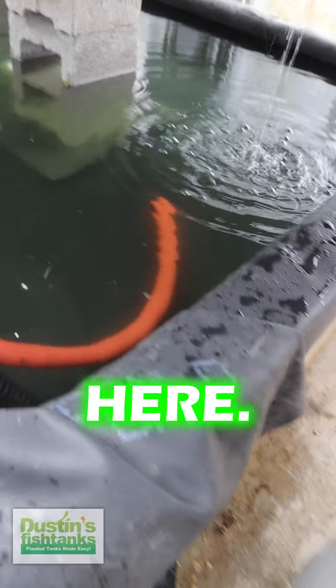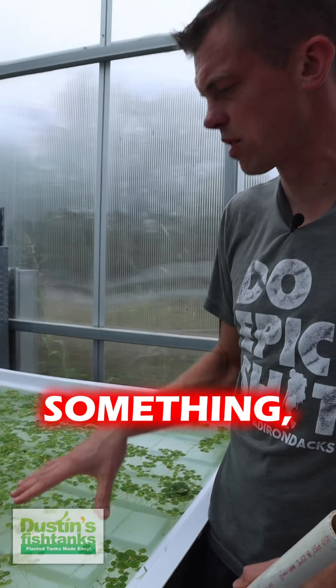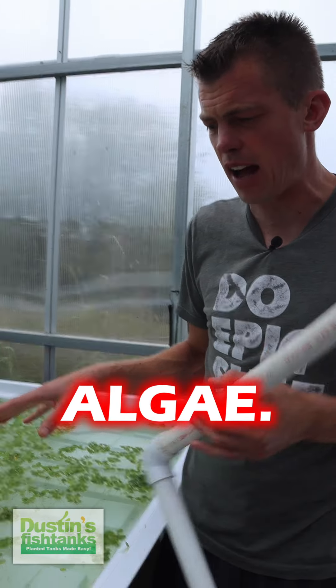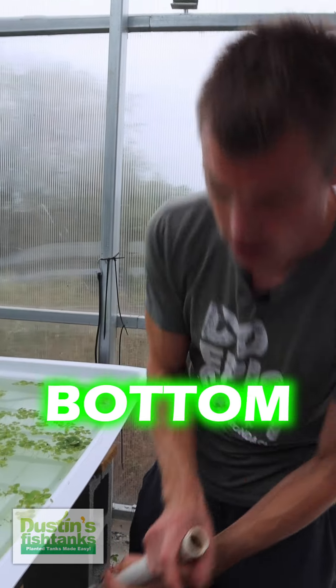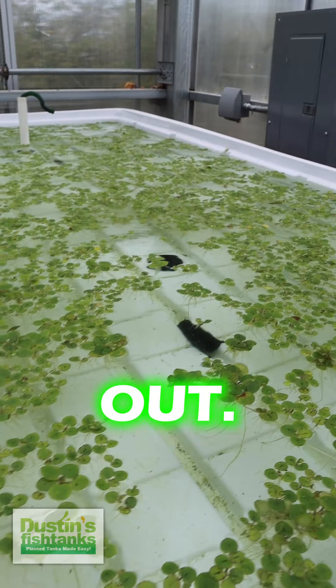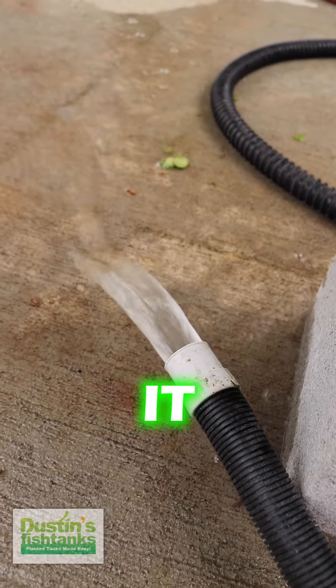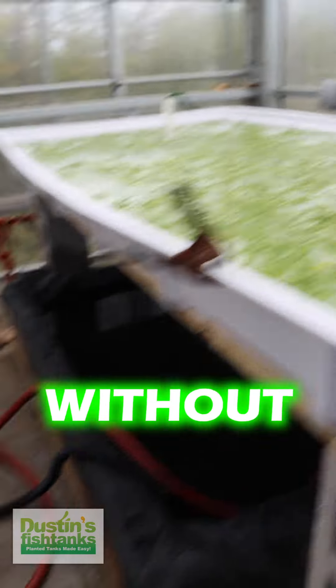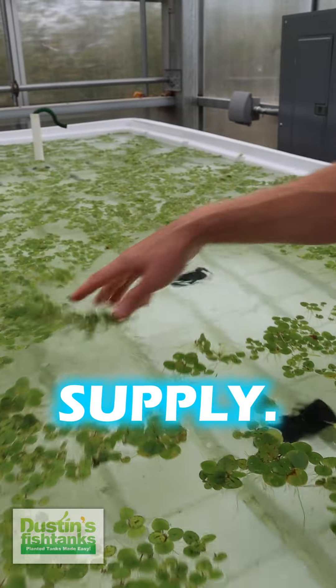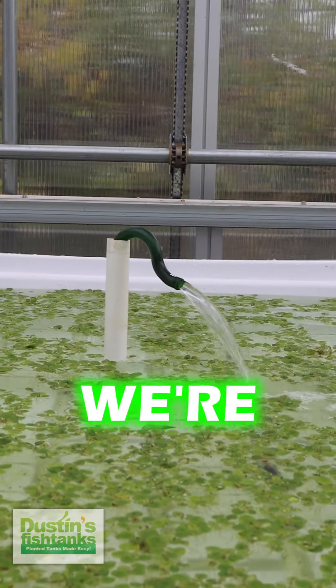But you can see this bulkhead fitting here. Let's say up here gets contaminated — something happens, someone spills something, or it just gets an insane amount of algae. We'll isolate the bottom basin, put this in here like so, and pull that out while that water is now not going down into the main basin and is cleaning it out. So we can stir something up without disrupting the main water supply, and then we can also fill the other ones simultaneously with fresh water, which is what we're doing right now.